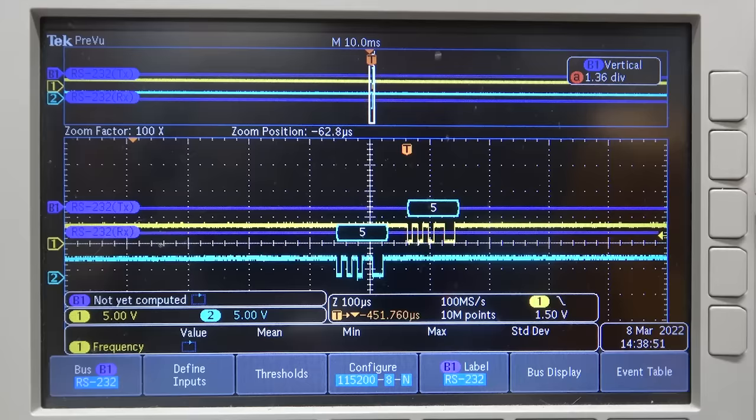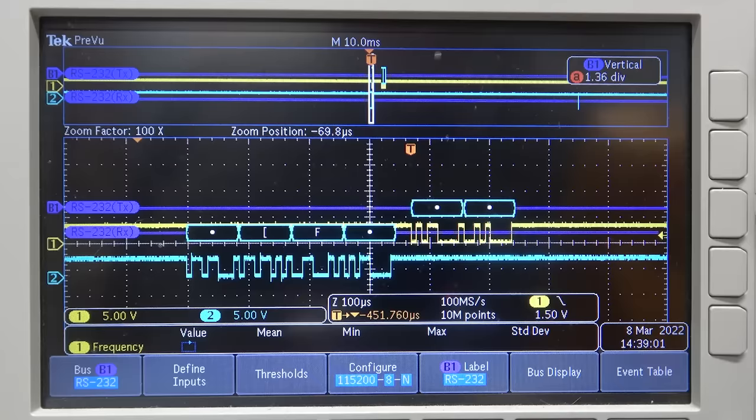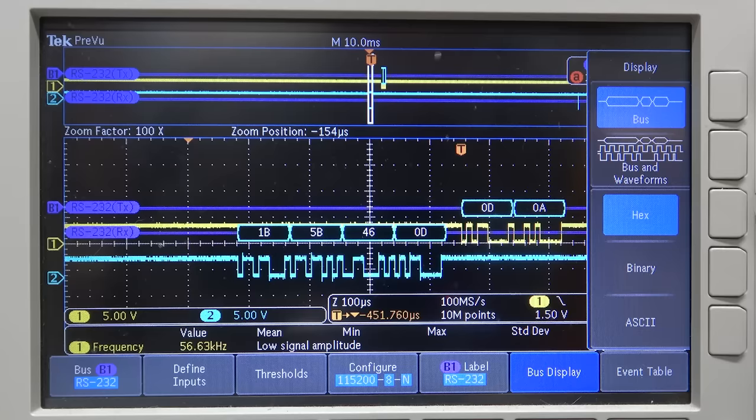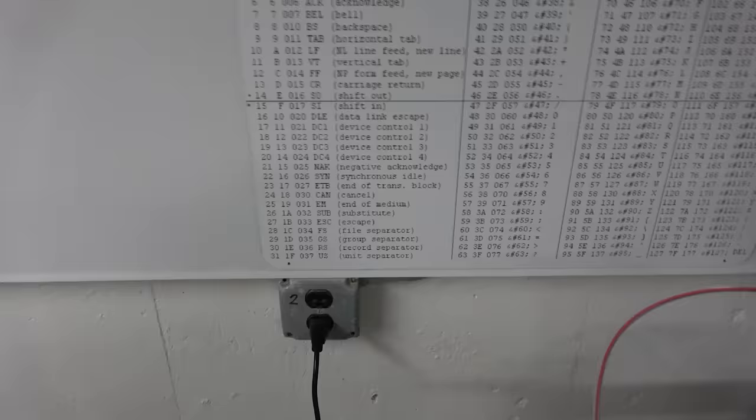Let's grab enter. So remember, I pushed 5, it took the 5, and then I pushed enter, and then enter generated this keystroke here. So I'm guessing the first thing is a non-printable character. I think we already saw this. 1B. Let me check what 1B is on my ASCII chart, because why wouldn't I have a laser-cut plastic ASCII chart in my basement? Right? 1B is escape.